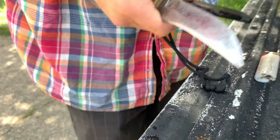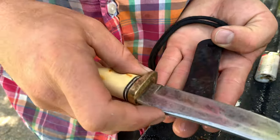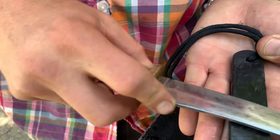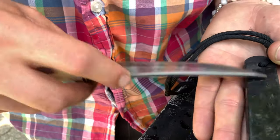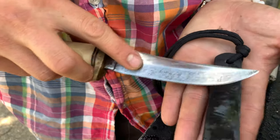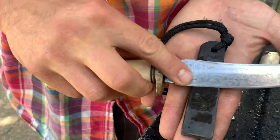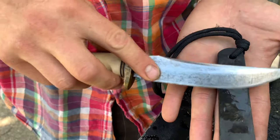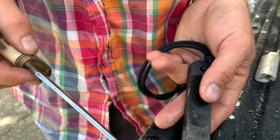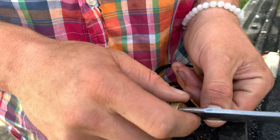If I feel a little bit of a crunchy feeling, I might wash my stone off, because at this point I'm trying to do finer work. I don't really want little chips in my edge if I can help it. It's especially true if you're straight razor shaving — it's not as big of a deal for other tools. But using a fine hard stone like this will give you a far better edge than just using a pull-through sharpener.